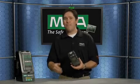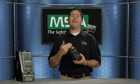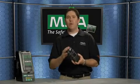One of the accessories available for our line of gas detection is the Galaxy automated test station, which will automatically bump or calibrate your MSA gas detectors. It is fully compatible across the line and will be available for the Altair 5. You can daisy chain up to 10 test stations — Altair 5, Altair 4, Altair, Altair Pro, Sirius, Solaris, Orion — and connect up to three cylinder holders to the right side of the Galaxy test station.